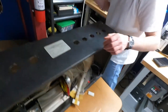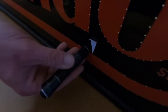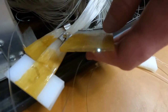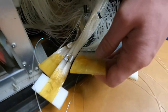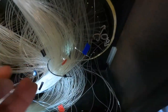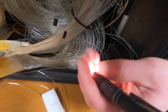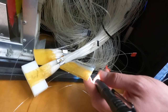What we did basically is, if you look at the front of this sign you can see where we've marked this fiber — now that fiber is out, the two on either side work just fine. We take a flashlight and shine it into a fiber on either side and see where it lights up in the bank. I can see this fiber and that fiber, so we want the fiber right in between those two. Then we shine it from this side, see which end is glowing, and then check in the bank if that's a match for being adjacent to the one we're looking for.